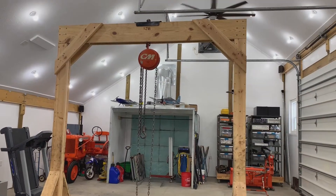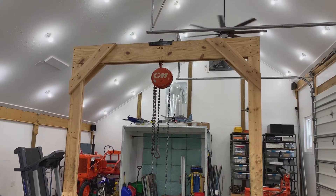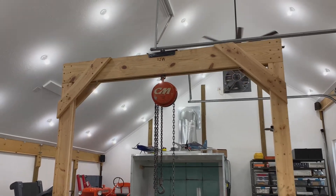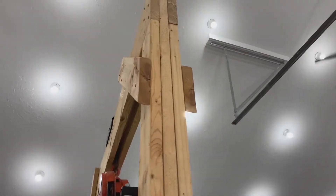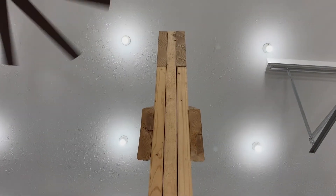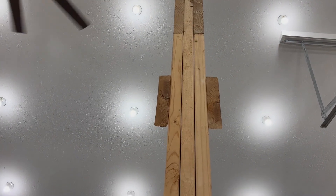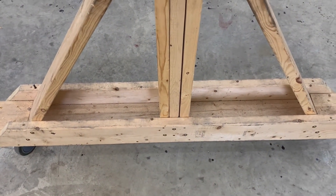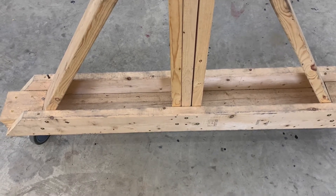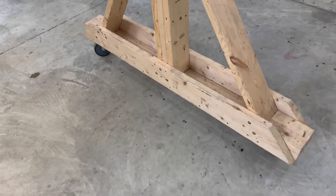The rest of the construction of this crane is pretty straightforward. The two beams — the 2x10s — are 8 feet long at the very top. The vertical feet are three 2x6s. The center 2x6 goes all the way up to the top, and the two outer 2x6s go underneath the beam. They come down to a base, which is a flat 2x6, and then two 2x6s make up the support on the inside and outside.